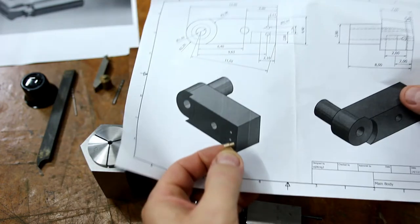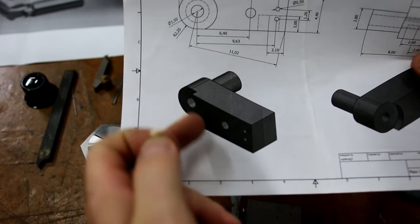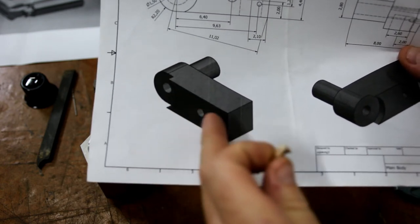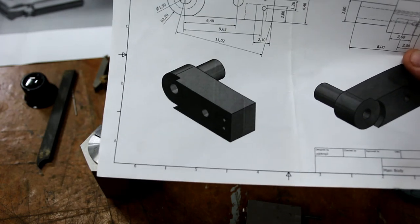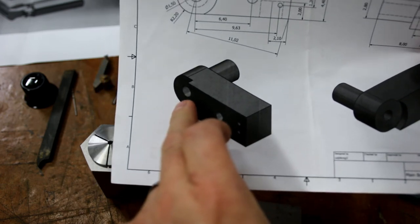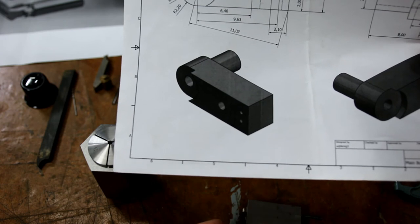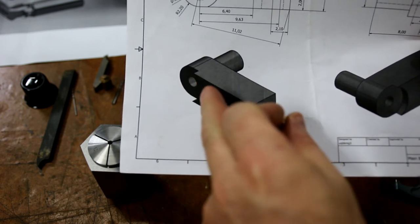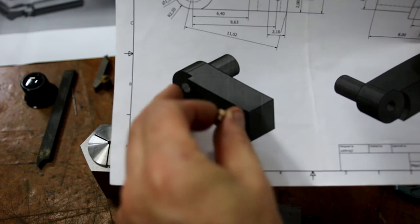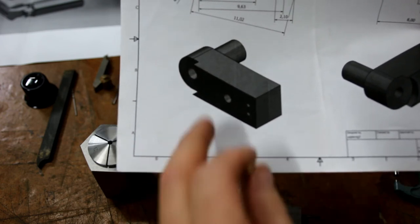Now the drawing, you see here, it's just got this little basically clearance section, so the crankshaft actually sits in there. Now I'm just doing that so that the cylinder can be closer to this face, and the whole idea is I want to keep as much mass out of any of the moving parts as I can, because the engine's so small it's going to rev pretty hard, and I don't know how many thousand rpm, but it'll be a lot. So I figure the big end journal on the crankshaft is only 0.8 millimeters, so you're talking 32 thou imperial. So I want to keep everything as small as possible, so that the cylinder is lightweight, the piston and basically the connecting rod is one item. So I'm going to keep all that as short as possible, so that it's as close to the crank as possible, so that that little 0.8 journal has less load on it. So I've got to do that now.